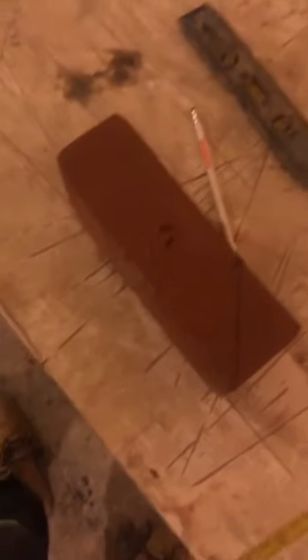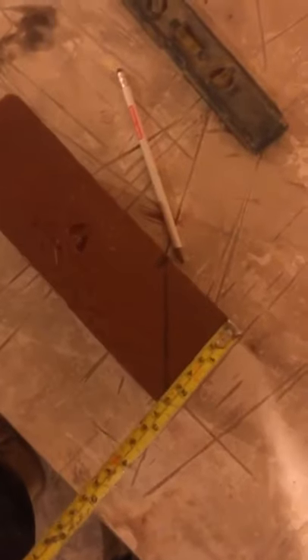This flat arch I'm going to be doing at 45 degrees. The best way to work it out is the brick's 63mm — measure that 63mm that way and cut there.